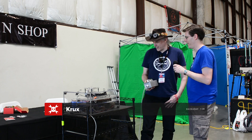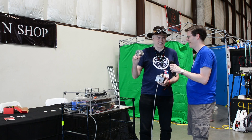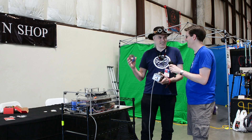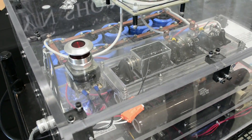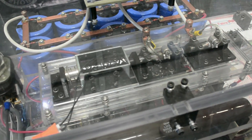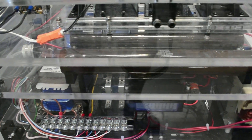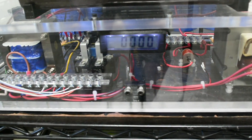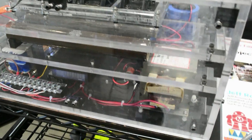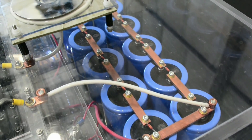And you're exhibiting what today? This is Project Hathor, so it's a form of impulse generator or ring launcher. This is just a standard hard drive platter — it's made of aluminum, it's not actually magnetic, but it's a conductor, and that's one of the key things that makes this work. We have a microwave oven transformer that goes to a bridge rectifier, which will basically charge up this capacitor bank. Once the capacitor bank is charged to a sufficient level, I can hit the fire button, which will close this contactor here, dump all the energy into this coil here, which will create a big magnetic field. Any time you have a conductor in a magnetic field, it causes electricity to happen, and any time you have electricity in a conductor, it causes a magnetic field. So the two fields will basically repel one another — like two north poles on two different magnets that repel. Same thing.